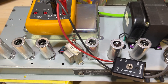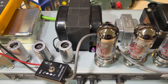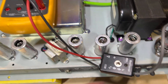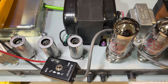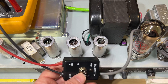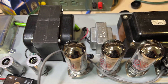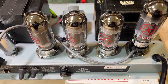To summarize: if you want to try this yourself, be safe and take the precautions we noted — don't touch anything inside the amplifier while it's powered, and always be hooked up to a dummy load or your speakers. There are pros and cons to all these bias tools. You could spend around $150 on a four-tube bias probe, or pick up a single-tube version for $30-50, or even build a kit for cheaper. You could look for a ComputBias — a more automated tool — for a couple hundred dollars, or find a used one.